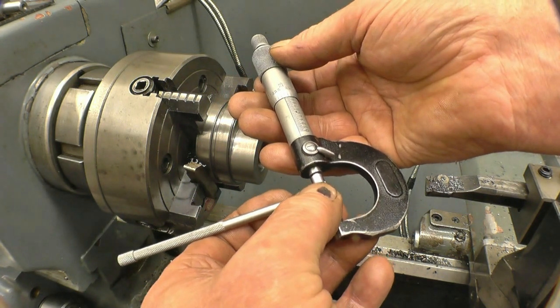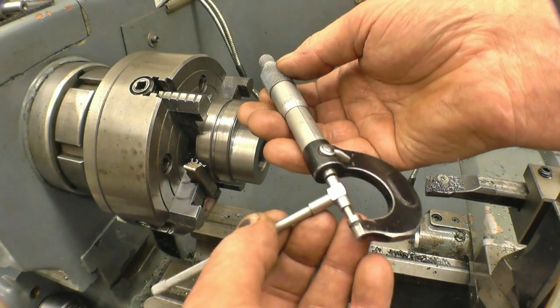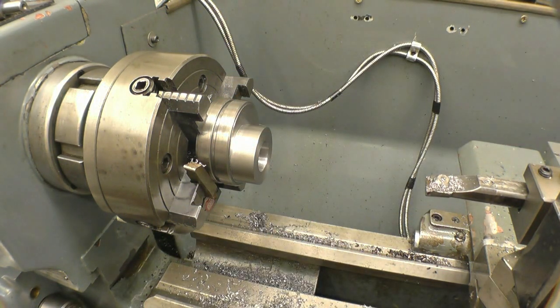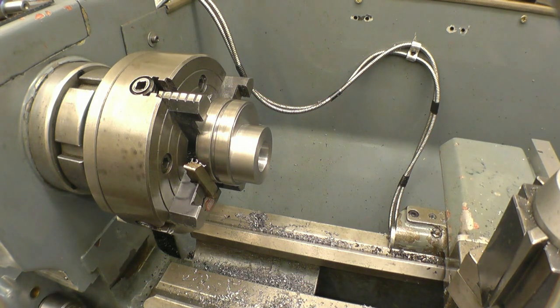That's 10 thou below inch. That's 1 inch there, 10 thou below. So 5 thou a side, we might take that out very nicely and put a good finish in there as well. I could bore it to size, but I have got an inch reamer, so we might as well use it.